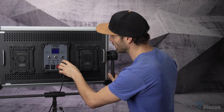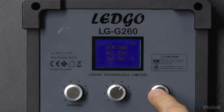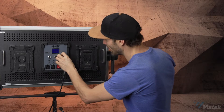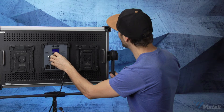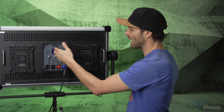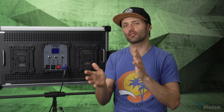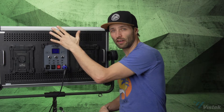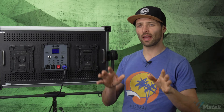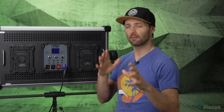My preference is to go into HSI — I'll go to the menu to access it since it doesn't have a hot button. In HSI mode, it assigns a number on a color wheel, so I can adjust whatever color I want on that wheel to a specific number. I did notice in my testing that the exact HSI numbers between this unit and the SkyPanel don't exactly match up — they're about 10 to 20 points out of sync. LED Go is going to match very well with other LED Go or Nanguang products, but it may not match with other brands' HSI values. It's an easy correction — you just swing the dial until the two colors look identical — but just be aware of that when matching different products.